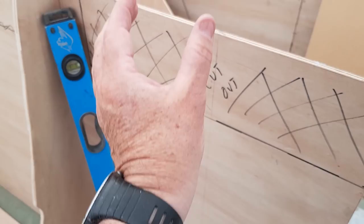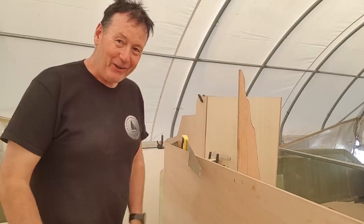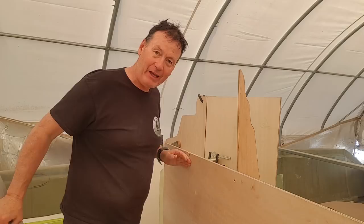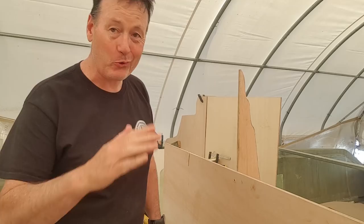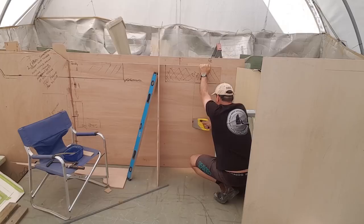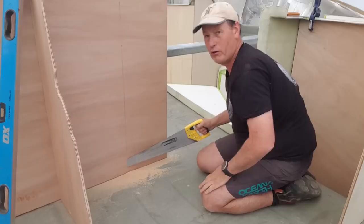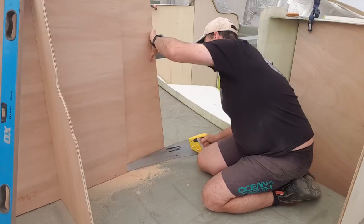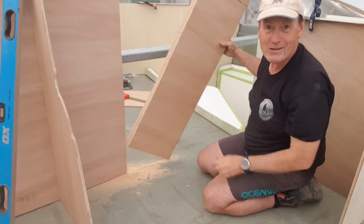I'm going to have to clamp a piece of straight edge on this side and onto the other side. That took a great deal of angst — string lines and laser levels — and we've worked out that I need to cut this bulkhead at this angle. It's around about 25 degrees, so my compound or skill saw won't cut it. I'm going to go very gingerly down this line, and ultimately it's not going to be as critical because it's going to be tabbed in glass anyway, but you try to get as close to the angle as possible. Probably a good hour of hand cutting — it's been a long time since I've used a hand saw to a level of accuracy.